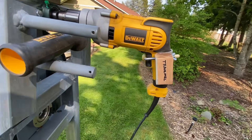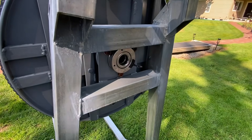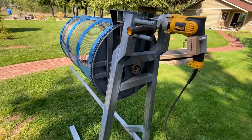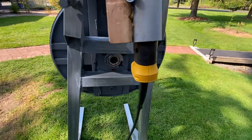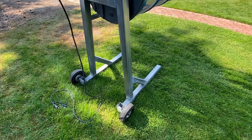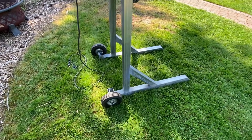It's got a half-inch drill that is the power source, a homemade trigger lock, and it's trapped between these two bars here — that keeps the drill from spinning. I used a Hyundai car spindle that I got from a friend; I'll put that part number in the description. There are a lot of these around — you could even get one from a junkyard. The frame is two-and-a-quarter inch box tubing off of a carport post.